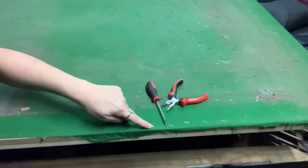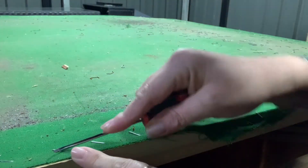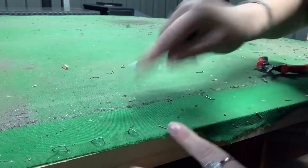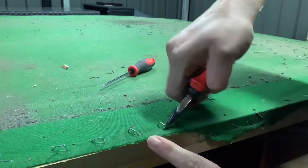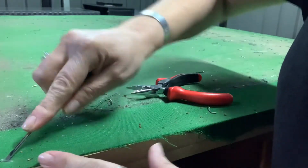Check out my frame — it turned out better than I expected. I could picture it but I didn't think it would turn out that good. I'm so excited to finish this project. Now I need to re-cloth my slab. I need to prepare it — take out all these staples and pull this cloth off. All you need is a flat sharp screwdriver to go underneath, drive it right under and pop them out, then with some pliers twist and pull them out. They're not hard to do, just time-consuming because there are a lot.